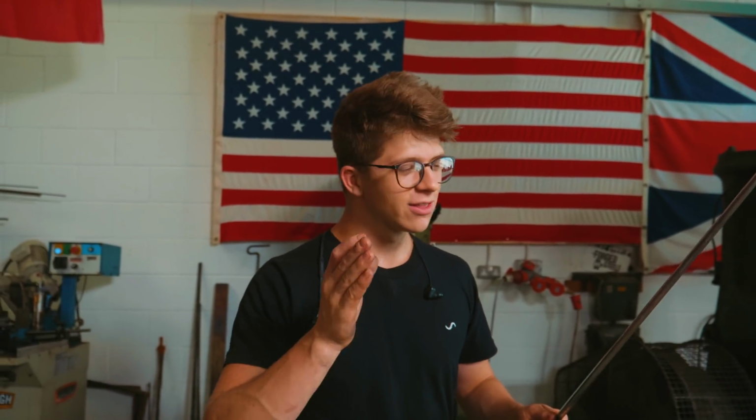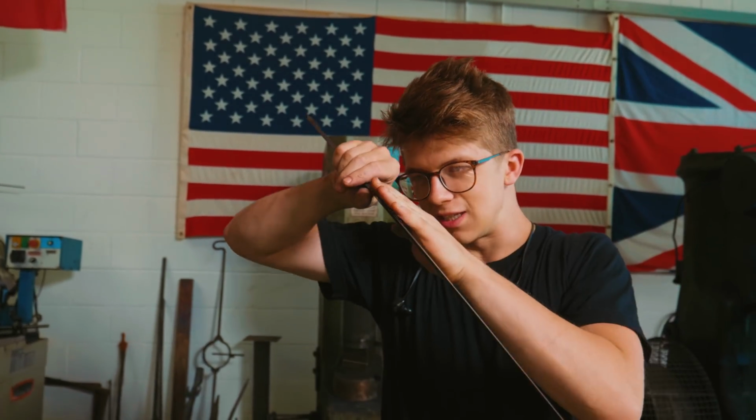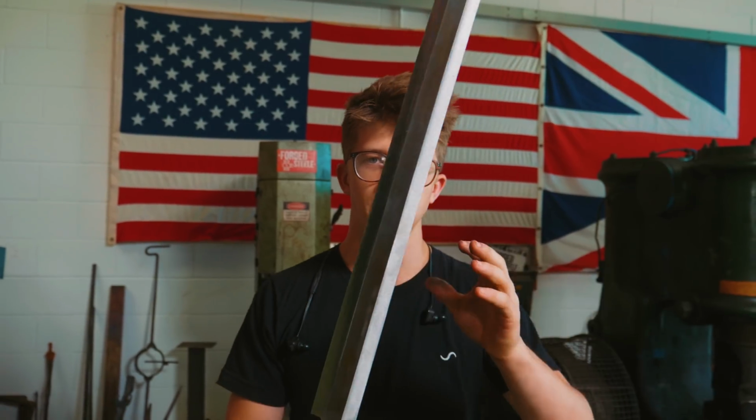Lots of people ask, why don't you just grind stuff in? Why do you go to hand sanding? The reason is, for an etch on a fine piece, you need an extremely consistent single scratch pattern that's going to go from here all the way down to the edge. We need the accuracy of being able to hand sand these edges without them bleeding too much, and that continuous true 400, 600, sometimes 800 grit finish is exactly what it takes to make sure that after an etch you end up with the best piece possible. And sadly, I have not found anything to substitute hand sanding.